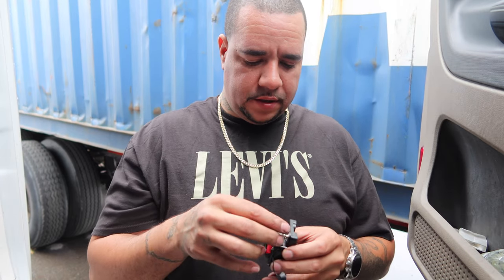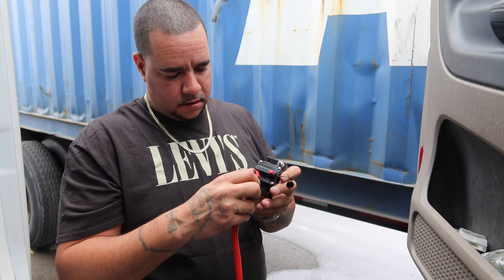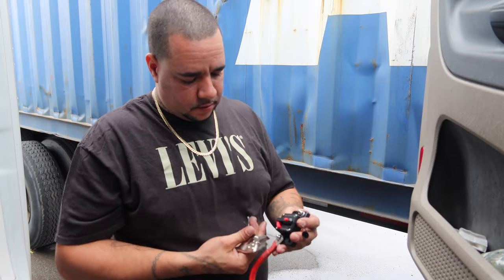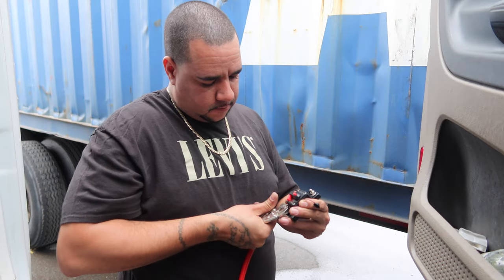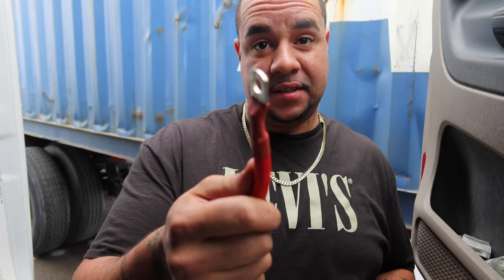For the circuit breaker, I'm going to open this up and take one of the nuts off, then stick the red wire through. The red goes on both sides, so don't worry about it — just clip it in like that. Make sure it's nice and tight and cover it. Now grab the other red one that came with the inverter. This one doesn't fit on the battery, but the one I bought at Harbor Freight does, so I'm going to run the red wire that came with the inverter to the battery.